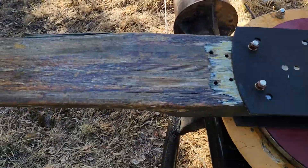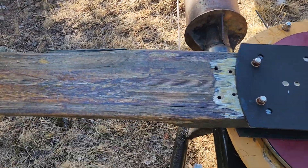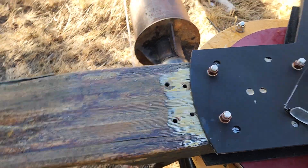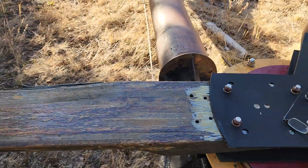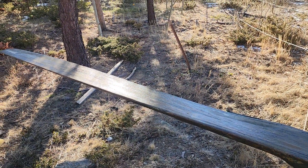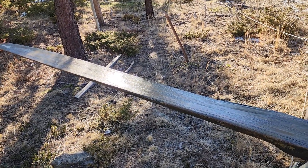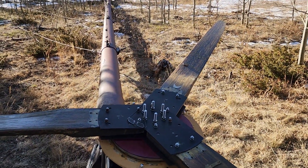People worry about the width and thickness of big blades. I just wanted to show — this is a 20-foot rotor and these blades are only about 8 inches wide. The wood is 3 inches thick. These start up fine in almost no wind at all. This machine will be producing power at 7 miles per hour. So we don't really need super wide, thick boards for blades like I see a lot of people doing — at least that's my opinion.